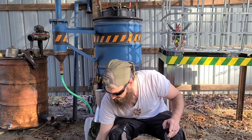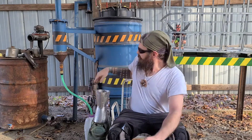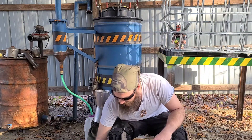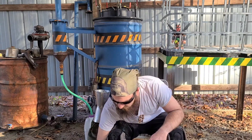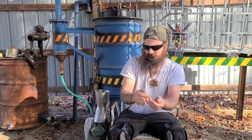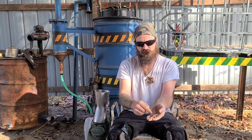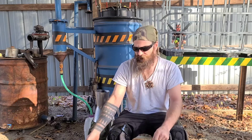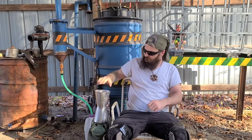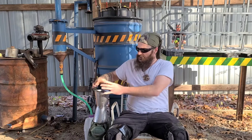I'm going to have these available pretty soon. It's just two of them in an hourglass shape. How this whole thing works is you take little bits of wood — just your fuel, little chunks of wood, like these limbs — you can get a wood chipper and make little bits like that. You'll find there's a certain size that your gasifier will like best to keep it from bridging, because it feeds down as it burns over this reaction spot. What you're doing essentially is starving a controlled fire that happens right here.